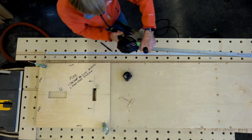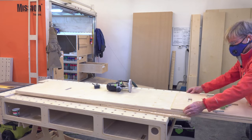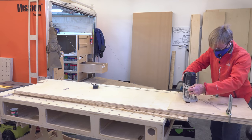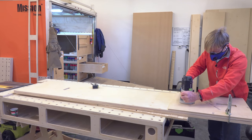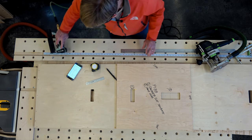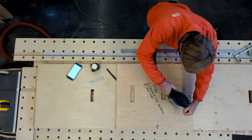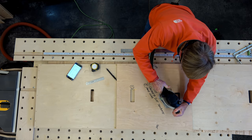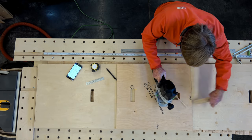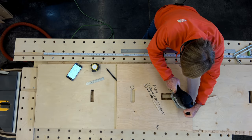Now I'm taking the pattern for the sawhorse slots — where the hinge barrels stick through to reference where the sawhorses nest up into the bottom of the benches. This is just one side of the sawhorse since there are two bench tops, one to the right and one to the left. Because the slot is a specific size and located dead center, either bench can be put on the sawhorse right or left — there is no right or left. I used the same pattern to set up the grab handle; there will be four grab handles, one on each bottom and one on each top, in the same location.